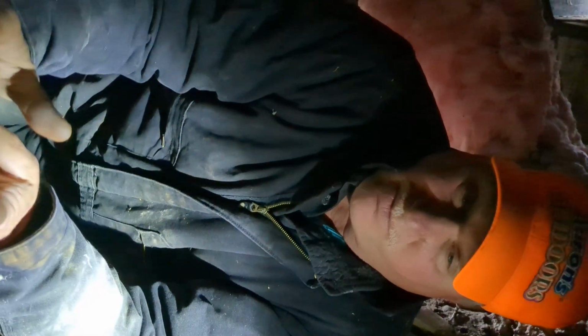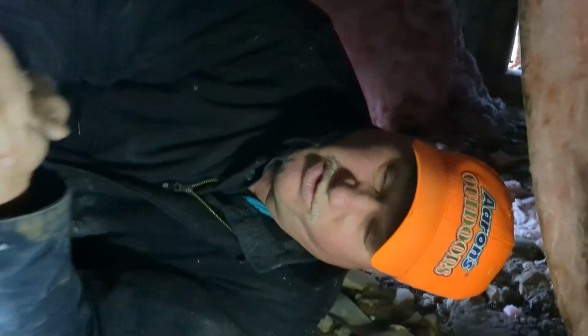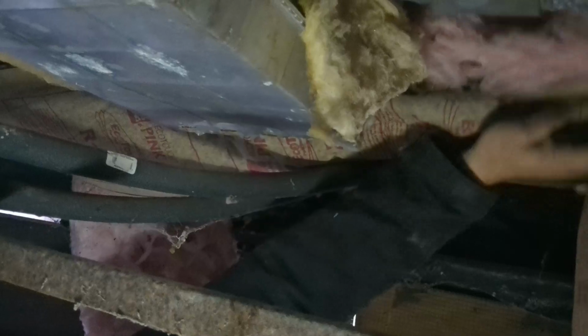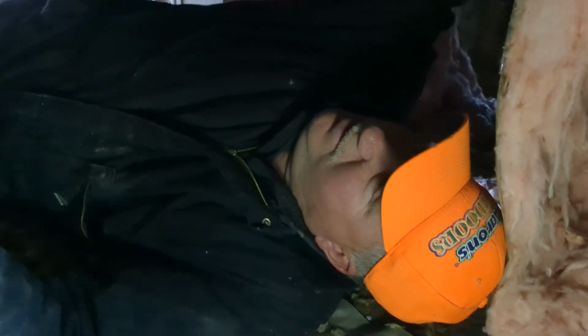We're going to be putting insulation in here to not only take it back to where it was, we're going to put R30, which is, you know, way bigger, 4 times more than what they put in from the factory. And we're going to be putting it in where there is no insulation. So somebody before us put in R19, which is still more. You notice how thick this is, and then how thick this is. This is R19. We're going to be putting in 30. Quite a bit of improvement, one to the other.